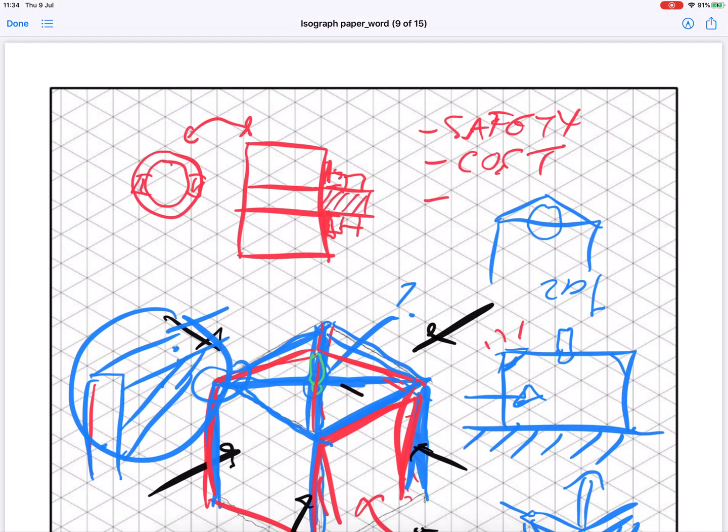But then when you think about the design side, well, obviously safety is a big factor. You've got this structure which is quite low, and you're able to bump your head. You've kind of mitigated that with a block of wood, which is fine. However, what you want to try and do is maximise the area inside the gazebo to prevent anyone from striking the structure. And also what you have to take consideration from a safety perspective is that your structure is much heavier than a typical gazebo you buy in, say, DIY shops. It's much heavier, and it runs a risk of injury if it was to collapse or fall. So you need to make sure it's properly stiff and safe.